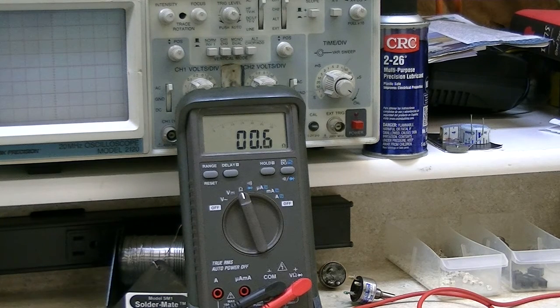This particular potentiometer caused a real problem. It was in a stud welder. We have two stud welders at work — one capable of about 7,000 or 8,000 amps, used for welding actual studs into a thick slab of copper. Then we have another one capable of maybe 3,000 amps maximum, used for welding Constantan rod into slabs of copper. Basically, you make a copper-Constantan thermocouple there.